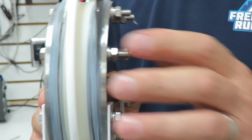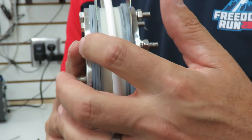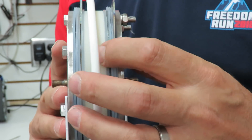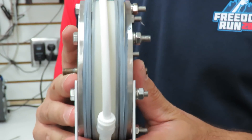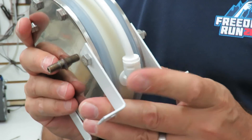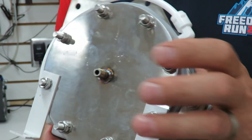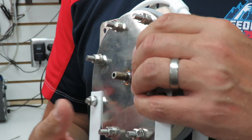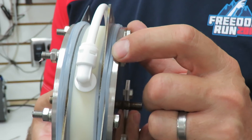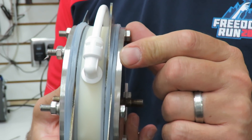This cell has two sections — I call it a double cell. There's a cell on this side and a cell on this side. Each side has a positive and negative plate, so each side generates hydrogen on one plate and oxygen on the other plate. The center section is a reservoir for water to enter the cell. There are ports here — an output port, a water input port for distilled water. And there are ports where the hydrogen comes out of the cell. This is a solid non-permeable membrane, so there's no way oxygen can pass through to the hydrogen side and vice versa.